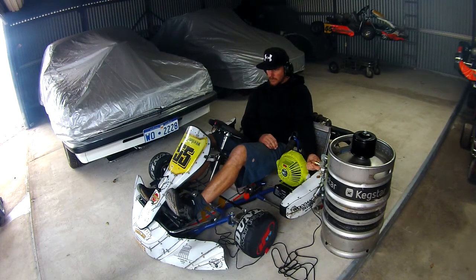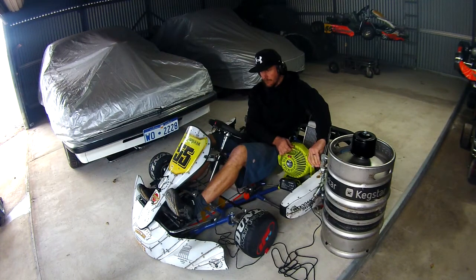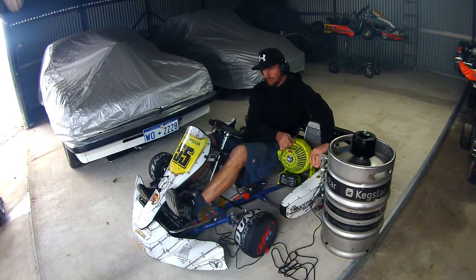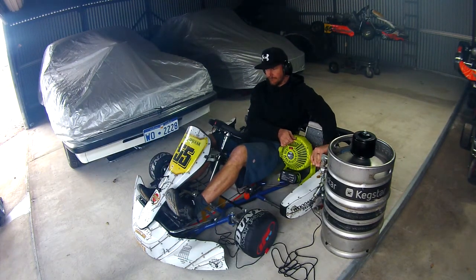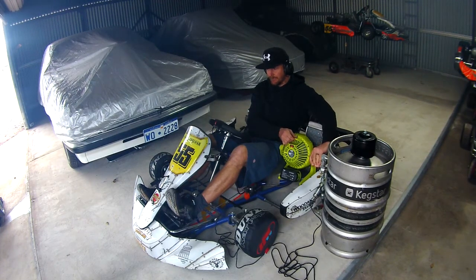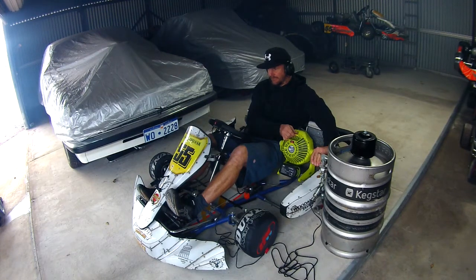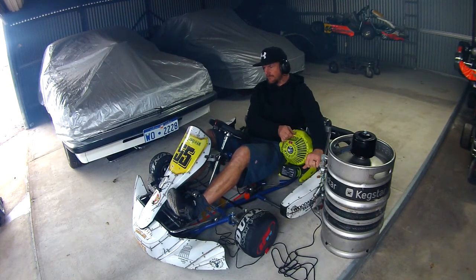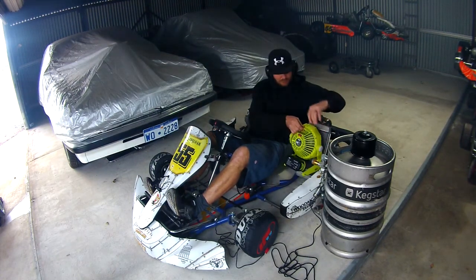After a couple of back-to-back runs, you'll see that the fan is on cooling the radiator. Essentially what I'm doing here is closing the valve right in. The idea is that you close the valve enough to make a restriction where the engine will no longer increase RPM. Once I've done that, I'll put the accelerator to 100% — and from then on I'm not varying the accelerator at all. The increase in RPM is only coming from opening up that needle valve, so we'll keep opening until we go right through the RPM range and stop somewhere near maximum RPM.